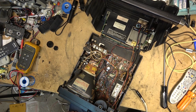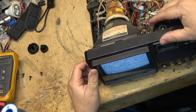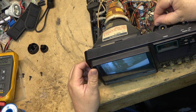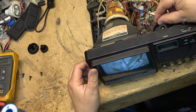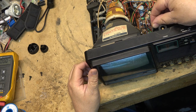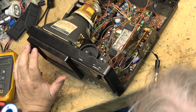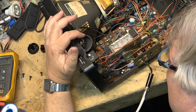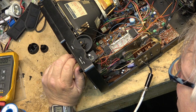I've got snow, lots of snow. Let's try the low band — I think that control is in bad shape. But it tunes in. Let's get some cleaner into that control and see if it will clean up. I think it's just a regular potentiometer on this one. I may have to pull the set apart to get at it because it's kind of in the bottom of this drum. Let's see the easiest way to get in to clean it.